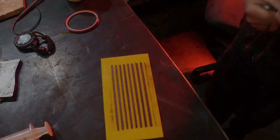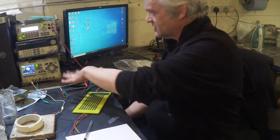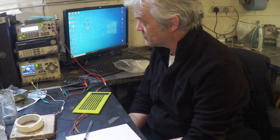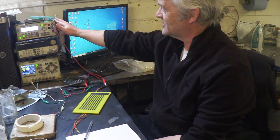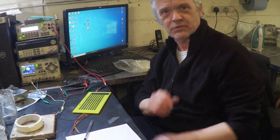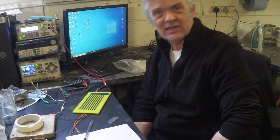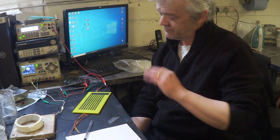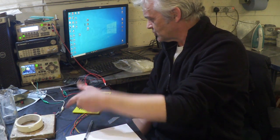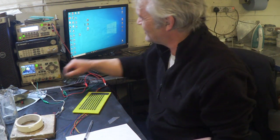Okay, let's drill it. So that's it finished. It's actually connected to the power supply — I've set it at 12 volts — and I've got my digital reader here and it's reading 4.9 volts. That's 0.1 volt difference, which is about one percent. If you think about resistors, they're usually five or ten percent in error anyway. So one percent — fantastic! We've got 12 volts in, 5 volts out of our painted voltage divider.